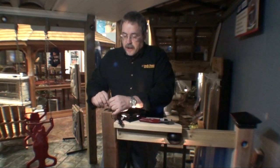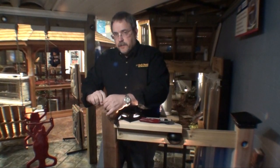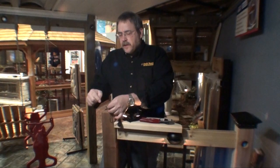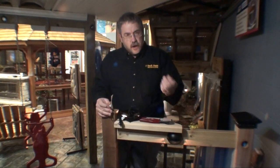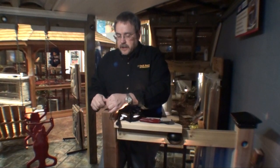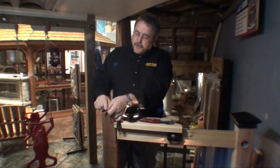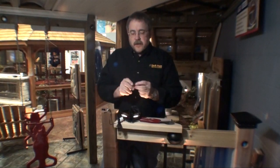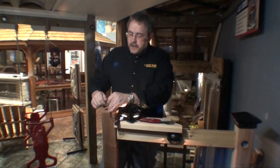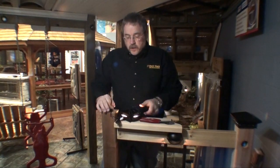Now this is normally done in the power off position, but for this demonstration I'm going to leave the power on. It's just a low voltage light — not very likely that we're going to cause an electrical hazard. And then we're going to hook these two together. Now it's important to note to stay five to ten feet away from your hot tubs — you've got to follow the other building and electrical code rules. But there you have it, we've got them lit up. Now we don't want these two wires to come in contact with each other, so we're going to use a gel-filled wire nut. Apply them over the top, simply press it in, twist them into place. That's going to keep any water and moisture from getting inside — they contain just a little bit of gel inside and it seals it up very nicely. They twist on — make sure they're good and snug.